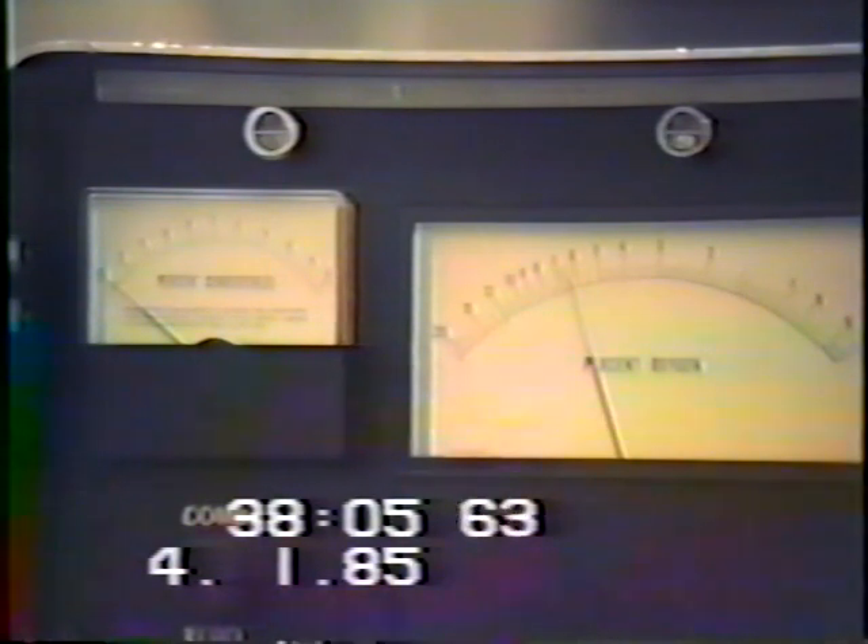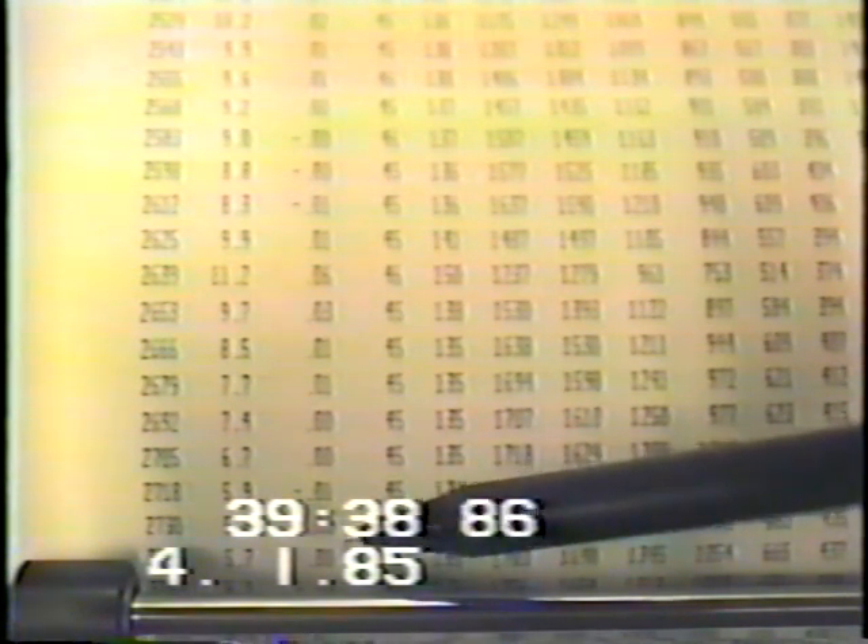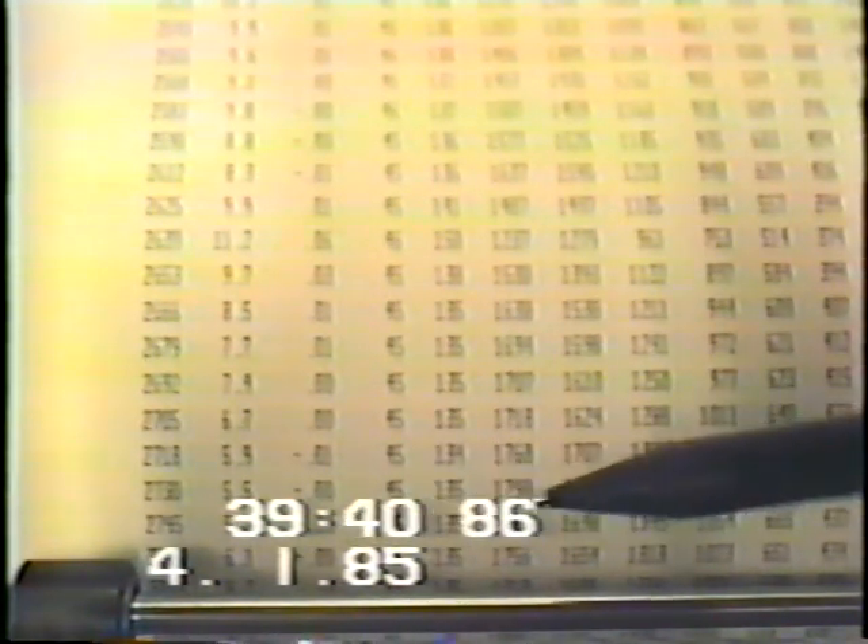This is our analyzer of all combustible materials. You can see the needle on the left is virtually at zero, which corresponds to the third column showing us now burning cleaner than a conventional oil or gas furnace. We're actually less than 100 parts per million, and our combustion temperatures are between 1,600 and 1,700 degrees.